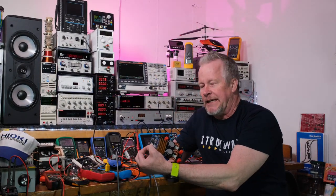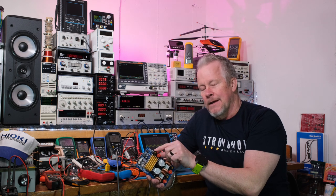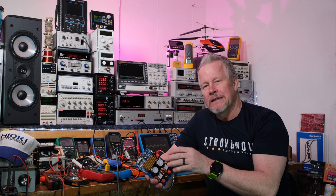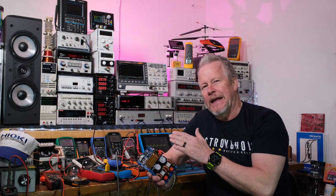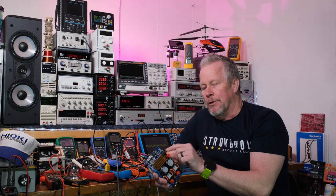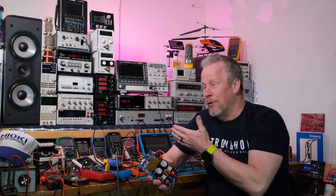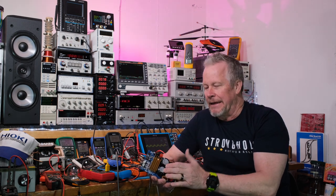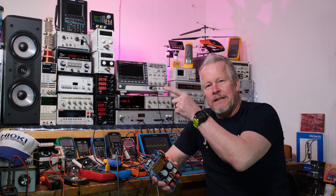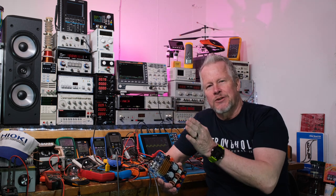So that was interesting — we looked at THD, then applied voltage at the power input terminals and could see THD increase. We could see how adding capacitors drops the noise and ripple. We could add even more capacitors to do a better job. We also confirmed that the noise and ripple is coming from the Class D switching at 450kHz — as expected. The power supply didn't seem to add extra spikes; it looked like it was all coming from the Class D, with spikes occurring as the ripple changes angle when the transistors switch on and off.